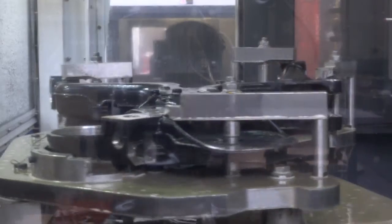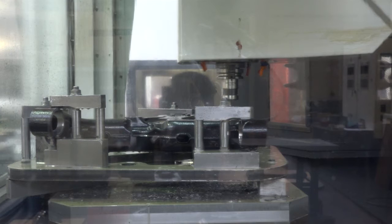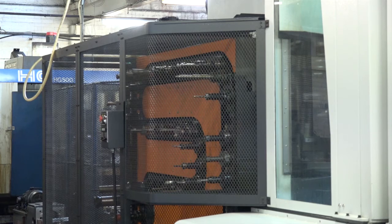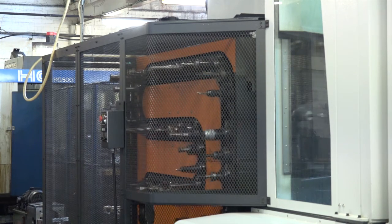The table obviously indexes, which we've got here, so you can position. There's not many angles you can't really get to. Pretty much all the angles — if you can't get it in the horizontal plane on an angle, you turn vertical and vice versa. So with it being a total 360 degrees, moving in very tight increments, that's what you can do. And when your parts start getting bigger and more complicated, you need more tools. How many tools has this machine got? It holds about 42 in the carousel — all the tools you could ever want, really.